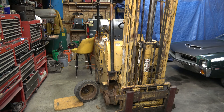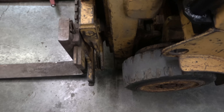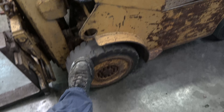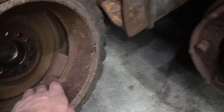I'm working on the Caterpillar TC30 forklift. I just used a floor jack, jacked it up here and put some blocks under the mast. The mast is pinned right to the frame because the wheels are off the ground. I zipped all these bolts out and then pried the wheel off with a pry bar. It looks like I'm about to get some shoes — the liners are just laying inside the wheel.